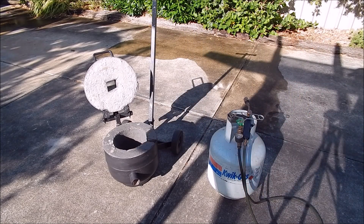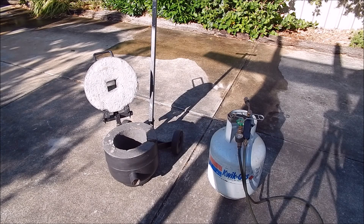I've got two lots of mixture. I did the lid with four to one, and I did the bottom section with three to one — perlite to refractory mortar. It's come up pretty good. I'll come in close and have a look at it.